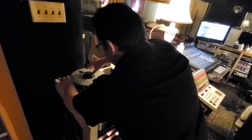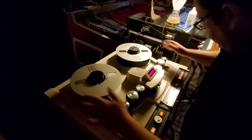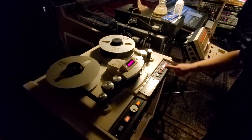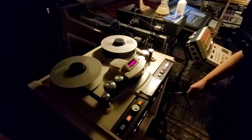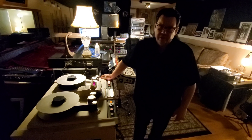We also had the tape machines in line today. We're going to go ahead and stripe it up — pull that out, come in like that, and then stick your finger here. Stick your finger right there and then get the tension up like that. Once you get some tension on these two pulls right here, hit the stop button and rewind.